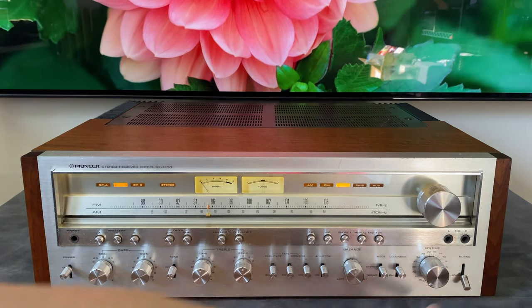One other thing to watch out for that you'll see a lot of times on these is on the back, check the antenna. A lot of times the AM loopstick antenna will get smashed or cracked. So make sure to take a close look at that. That antenna piece can be sourced, but it involves tracking down the solder points inside of the unit, maybe splicing some cables in. So again, like these indicator LEDs, not the easiest to replace for a beginner, but it is possible.